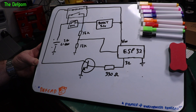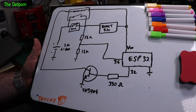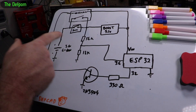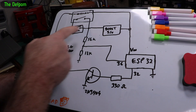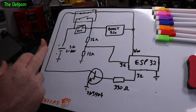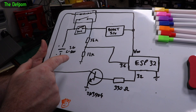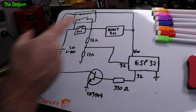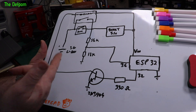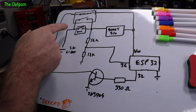I've drawn out a circuit diagram to explain how this is actually constructed. You've got a 3.6 volt lithium battery — you could use any battery voltage as long as you can boost or drop it to 5.1 volts. A single cell is just simpler to deal with and lasts for ages.